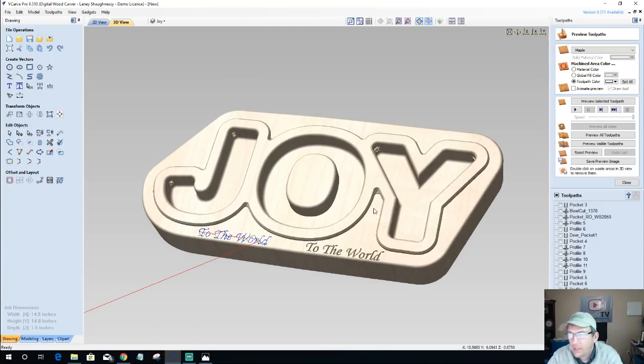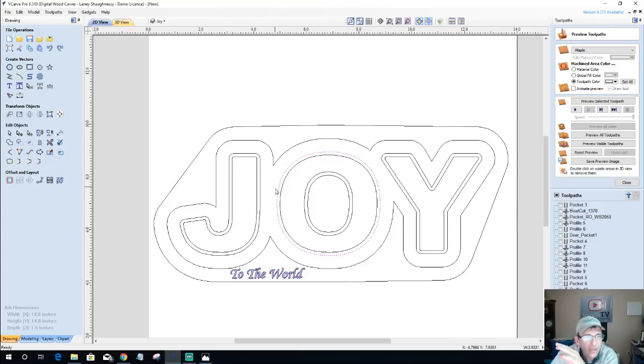So play around, have some fun, make some bowls. Now, it probably got confusing with the offsets and everything. Just so you know, the reason we're offsetting this vector inward that 1/8 of an inch is because all of this area between these two vectors is going to be waste material milled out with the quarter inch end mill. Instead of the bowl bit having to mill all of this out, we're going to hog away this waste with our quarter inch end mill, all of this waste in here, these inside vectors, so that our bowl bit doesn't have to work that hard when it mills that remaining eighth of an inch around the inside of our normal vectors. So that's the way we've offset inward.